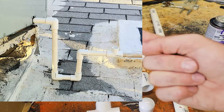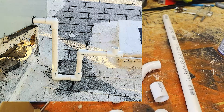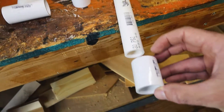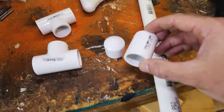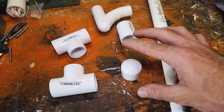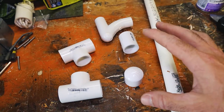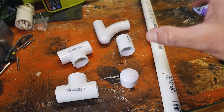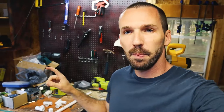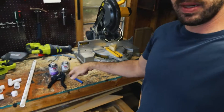I'll throw up a diagram of what some other people do. Then I'm going to have a coupling — which really just extends PVC to more PVC — and a cap. All of these are very important. You'll see many different designs online, but this has all the foolproof pieces you need to have the best possible working condensation line. I'm going to build most of this here in the workshop and then take it over to the HVAC system and finish it up there.